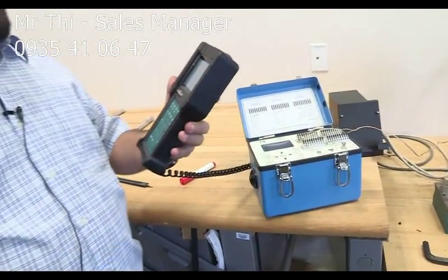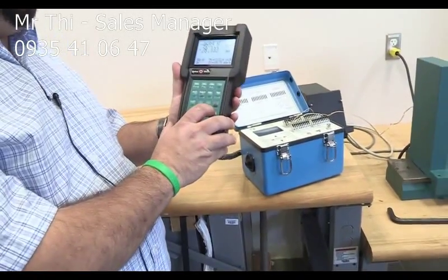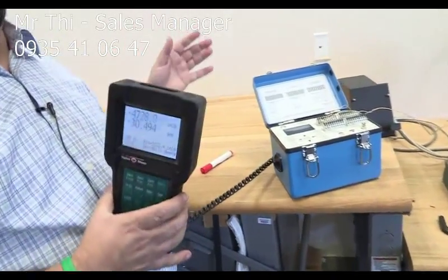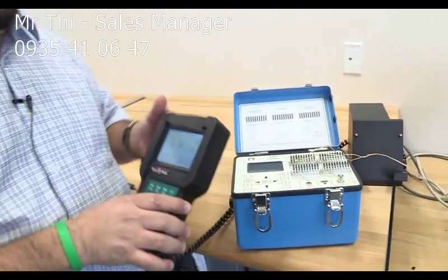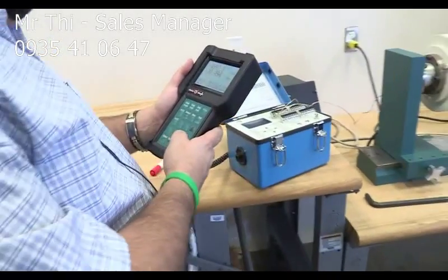And you keep going, up to the failure point. Again, for the first 10 readings, maybe at 5 degrees increment or 10 degrees increment, it's your call. And then you read that, and then you load it to failure. I'm going to load it now to failure. Okay. So let me load it to failure.